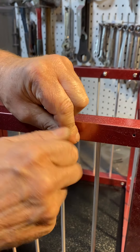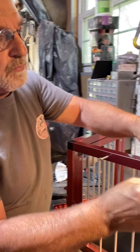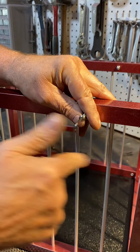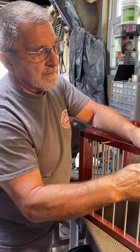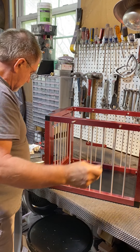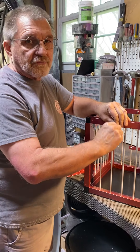These holes are spaced at seven and three quarters on center. So if you're retrofitting a kennel berth or a trolley with our systems, you have to drill these holes and tap the front side — the side that I'm screwing this into right now. It's a 5/32nd hole tapped with a 3/16th or a number 10-24 tap, which is a coarse threaded tap.